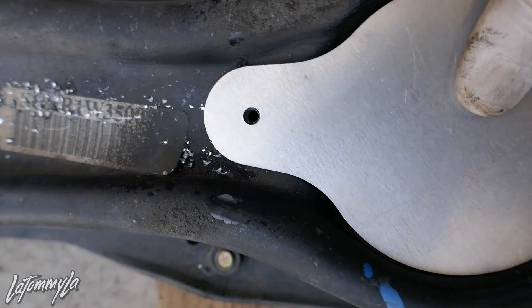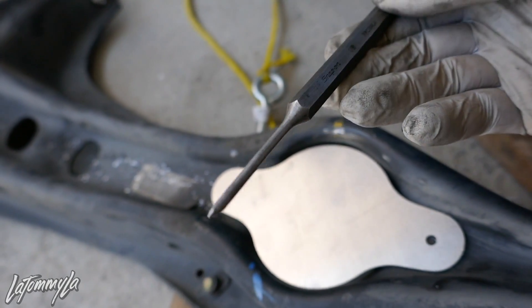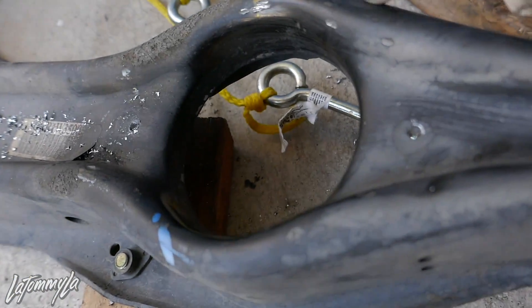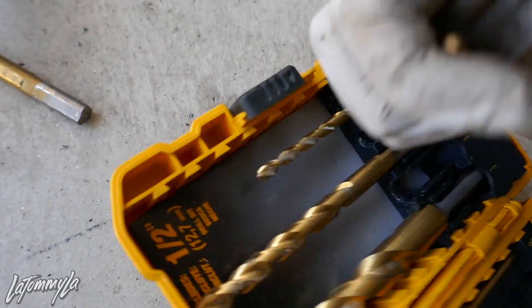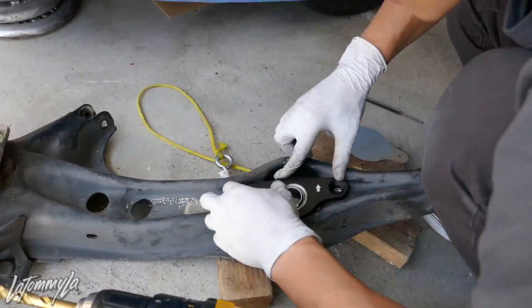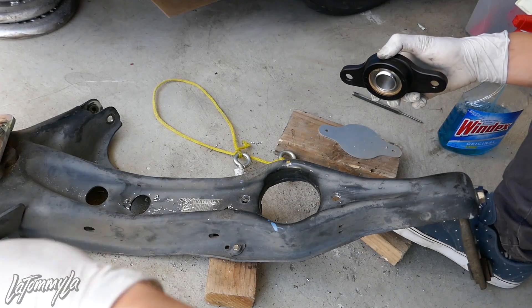There we go — and that's centered. That's exactly why you should use a punch. I'm using a 1/8-inch punch by Snap-on, but you don't need Snap-on — Craftsman works fine. Now I expand the holes bigger to fit the bolt: I go from 1/4-inch up to 3/8-inch so I don't make the hole weird. They fit right in — now to clean up the metal shavings, and wear gloves; metal splinters suck.